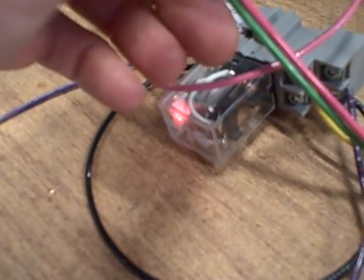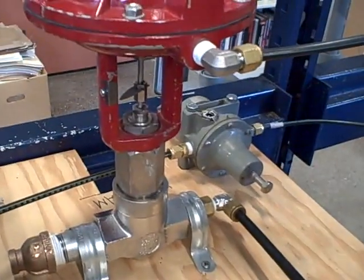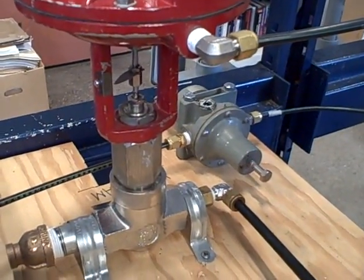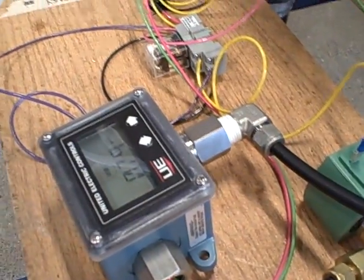You can also see that our relay right here is on, showing us we're in a latch status. Go ahead and open the valve back up again. Now we're going to open up this control valve and allow the pressure to re-stabilize in the vessel, but being a latching safety system it's relying on me to push a push button over here to get it out of the latch state — and now it's working again. It's re-armed and it's able to trip the system if it needs to once more.